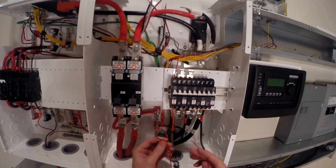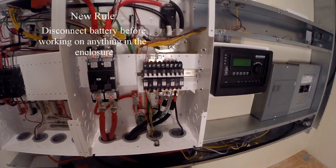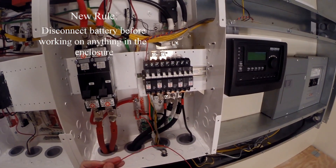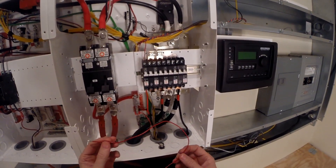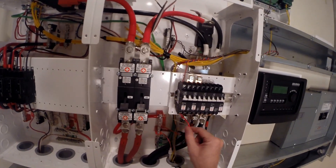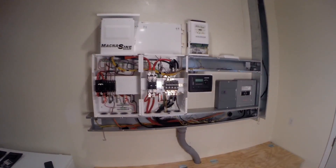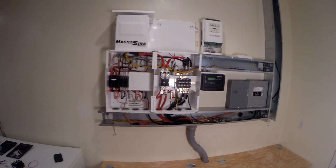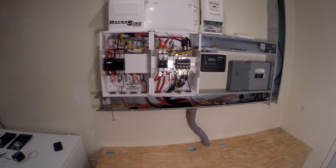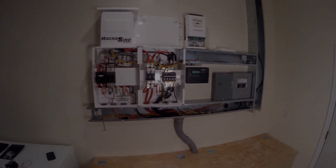The lesson learned is that stuff in this area isn't really fused effectively — it is, but it's a 200 amp fuse. So a little wire like that is just going to sit there and melt because you're not going to hit 200 amps, but it's something to be aware of. Now I've got this little fused wire that I'm going to use for little stuff. Anyway, that's it for problems, mistakes, and accidents part one. Stay tuned — you might see the falling off the roof or who knows what's coming up. Thanks for watching.